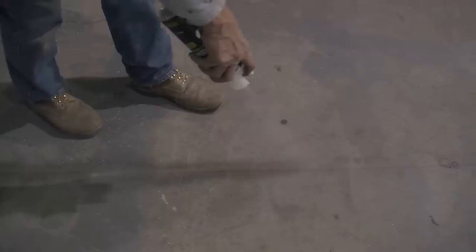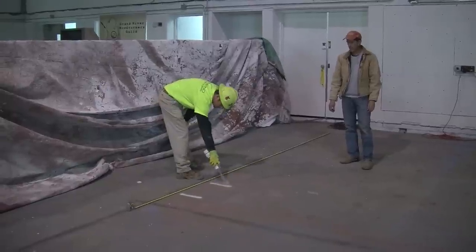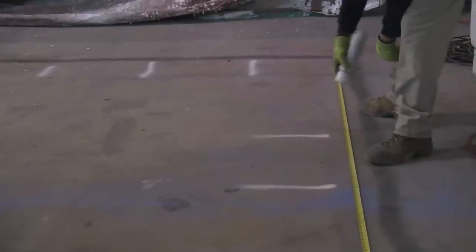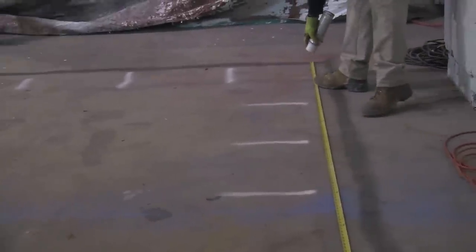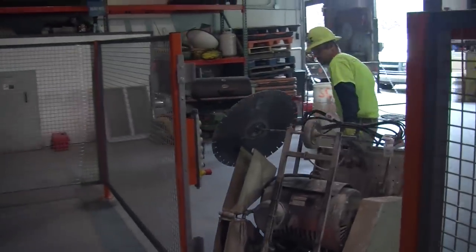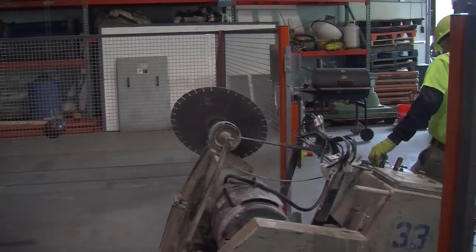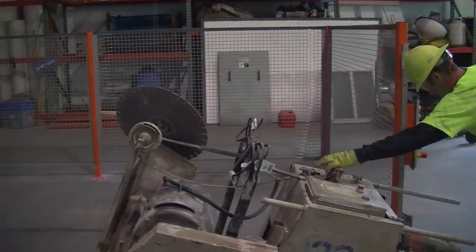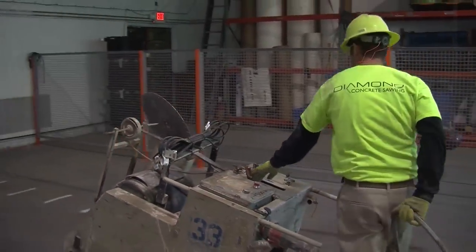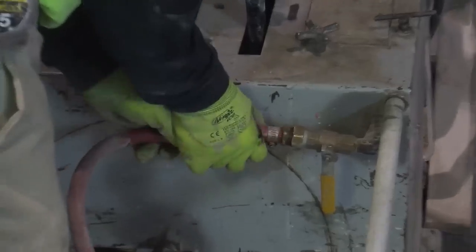The floor in the room is a three-inch thick concrete slab sitting on top of a two-inch thick concrete mud slab. That isn't big enough for us to mount the robot to — it simply doesn't have the strength to handle the weight and the torsional loads from the robot. So we decided to go a step bigger than we did in Kalamazoo. The original installation for Jeff was a twelve-foot square; here we went up to a fifteen-foot square, and instead of being one foot thick, our new robot base is actually two and a half feet thick.